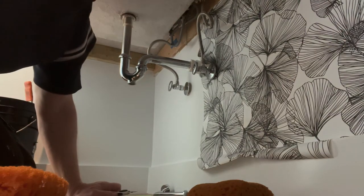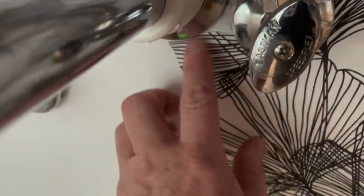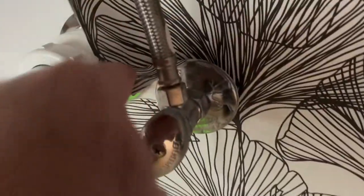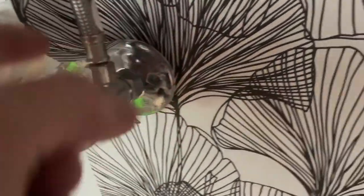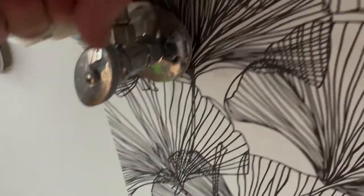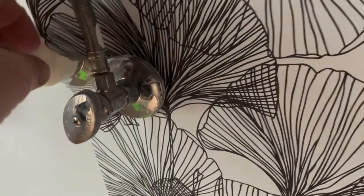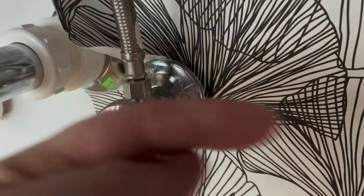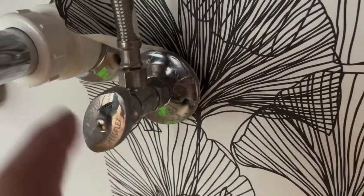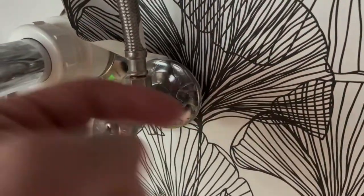Let me take you up here. So far, so good. But now look, we have that piece. And we gotta join this piece to here. Now, we want to make the cuts under the escutcheon, and we want to go this way, because if I go this way, I might overcut it. Okay, do you understand why? If I go this way, I won't overcut. If I go this way, it's guesswork. So we want to go toward where it's hidden.